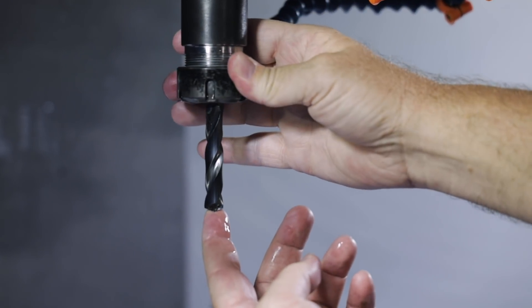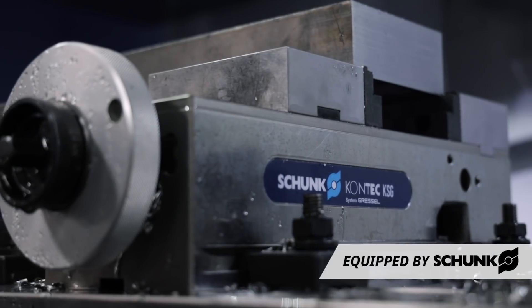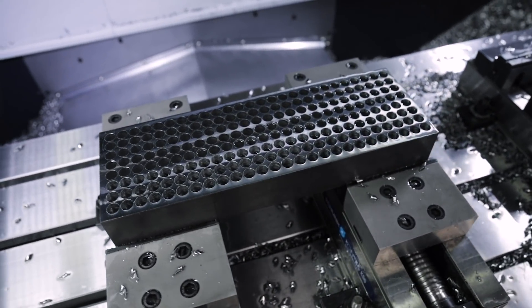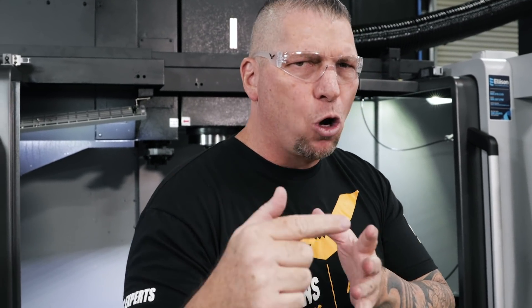The HPX drill: 208 holes in 6 minutes and 30 seconds. Our Z depth was 1.85 — more than three times diameter — and that drill absolutely killed it. We actually went higher with our feed, even more than what Kennametal told us. But you know what that did? It allowed us to break those chips into nice pieces, and they just came out perfect.